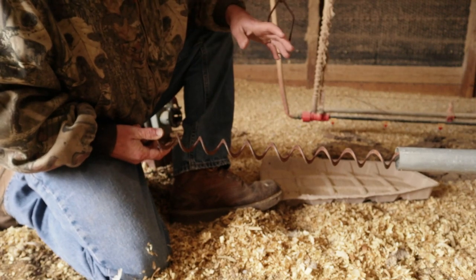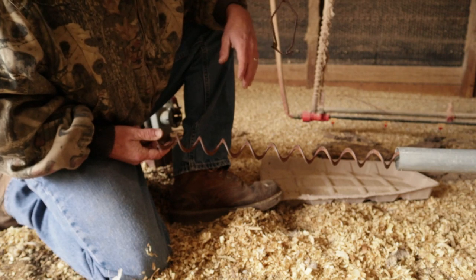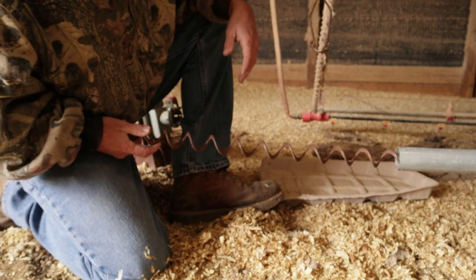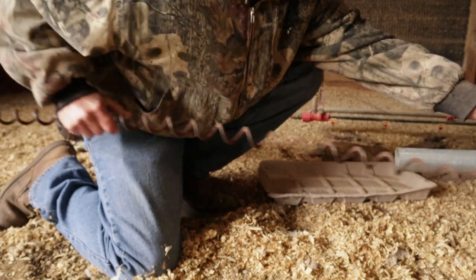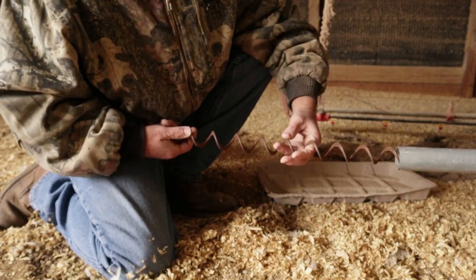That's about right. These things need 7 inches of stretch per 100 feet. So it's a couple hundred feet to the middle. So we're looking at 14 inches of stretch, and that's about what I'll have. It's about 14 inches in. So I'm gonna screw it in some.